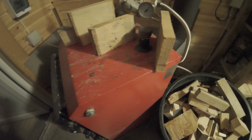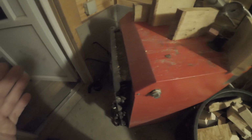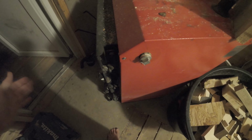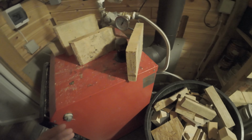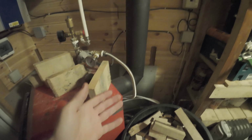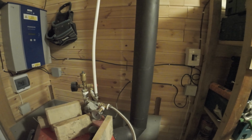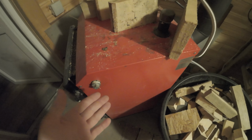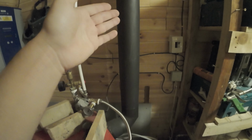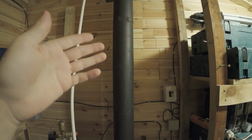So you need to have a tank. The tank will provide that the wood can burn with a good airflow. A good airflow will cause nice heat inside the oven. Nice heat will cause even better airflow, and the vapor from the wood will be all sucked out pretty nicely. If the valve closes, airflow is less, burning less, smoke more, the chimney will be clogged and dirty from the inside, and you can start having risks of fire, chimney burns, I mean.